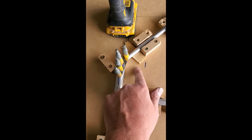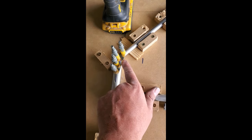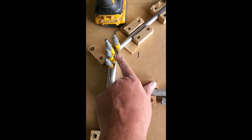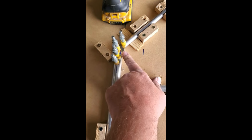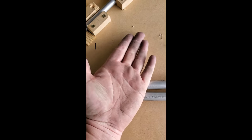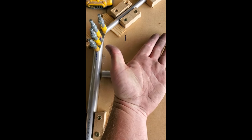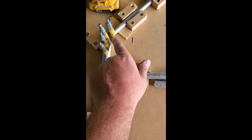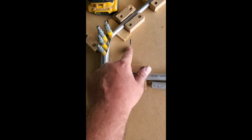One thing that's smart to do is to mark your gusset on the table and on the outer face of the gusset itself. So if you're priming your parts, you can do a whole bunch of these gussets at one time, number side down. And then once that's primed, you can come back here and know, because you didn't prime over the number, where it goes.